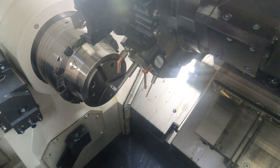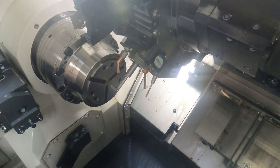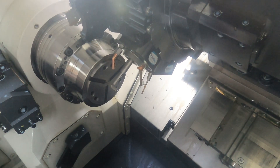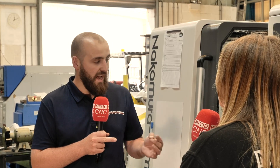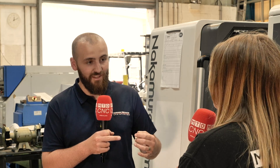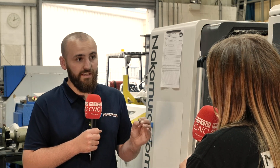The operations on there — you can see we're milling the faces, drilling, threading — all with live tooling. The live tooling is doing the flats and putting in the cross hole, and the conventional turret is doing the drilling and the tapping. It's rigid tapping, which is something we struggled with on our old machines. This is M4 in 316 stainless steel — quite a small tap — and it's doing it consistently and not slow.